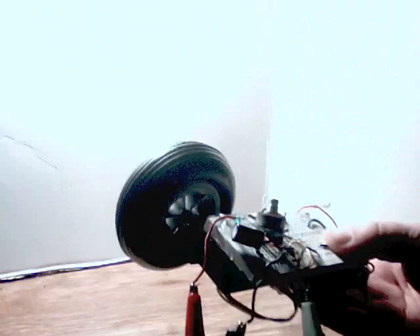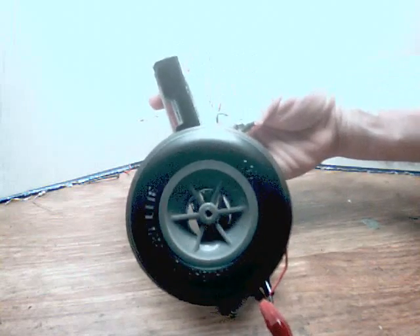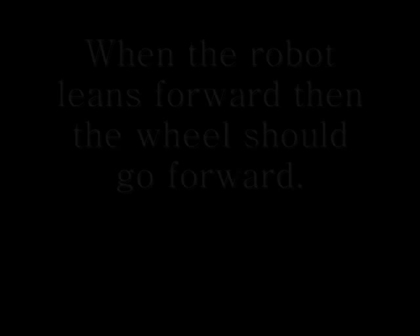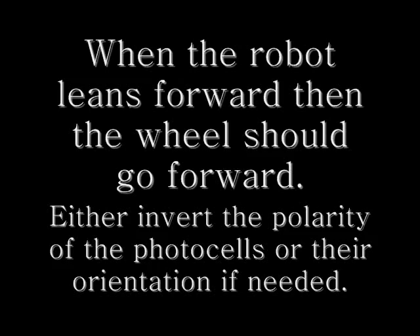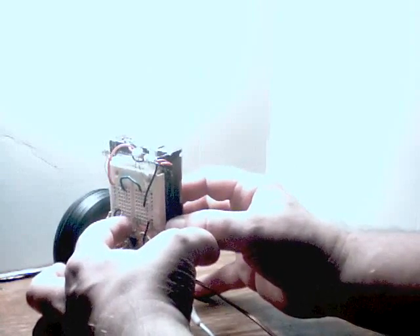You'll be at about a 1.5 millisecond pulse. With the proportional resistor and the 15K resistor in, as you move the robot to lean forward, the wheel should go forward — and just the opposite. If it doesn't go properly, then swap the polarity or orientation of the sensors. This is proportional only, and that's good — you want to be able to get it just barely to where it might balance.